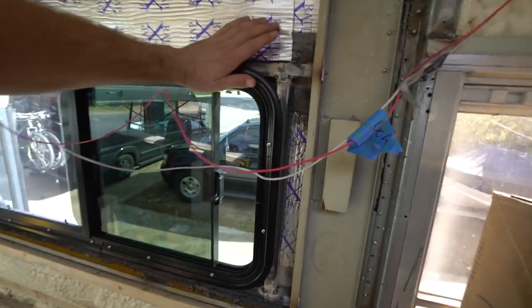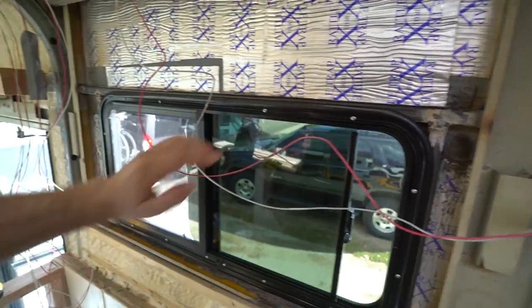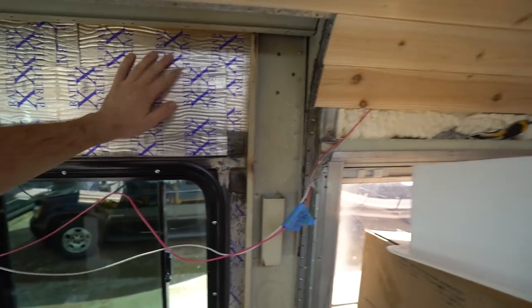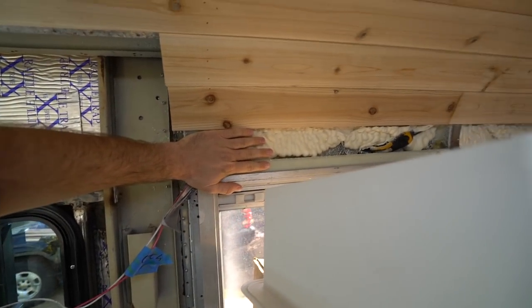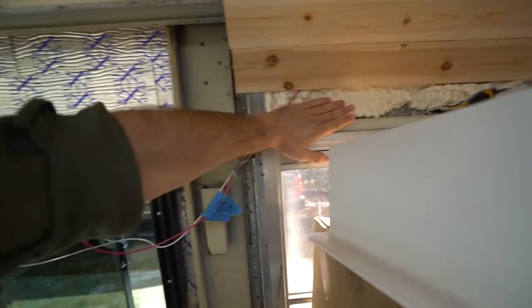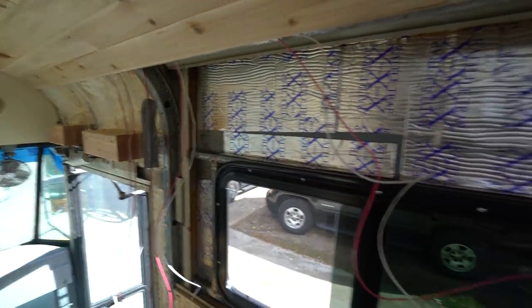This thing, it's been overnight. This thing is holding up pretty well here. Wow, it's crazy. There's so much heat coming through this right now, and there's nothing coming through this. Tons of heat, nothing. Partly because it's gray, partly because there's no spray foam insulation.